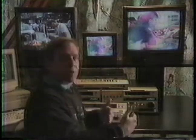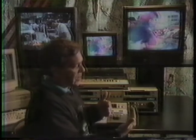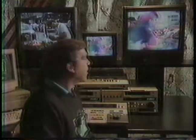The problem lies in the tail end of the assemble edit. When you stop the machine at the end of an assemble edit, there is a section of tape that has nothing but snow on it. It has no sound, no picture, and especially no control track. Some people call this a glitch, I've seen, but I think a better name for it is a bloody great electronic hole. There's nothing you can ever do to that bloody great electronic hole to cover it up.